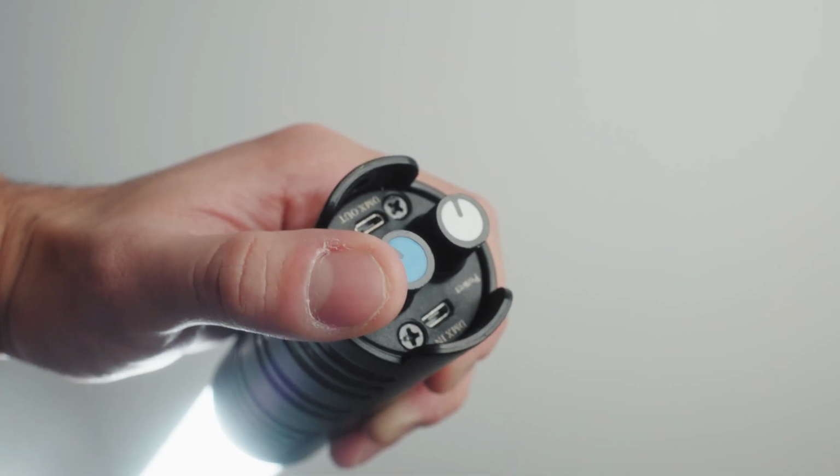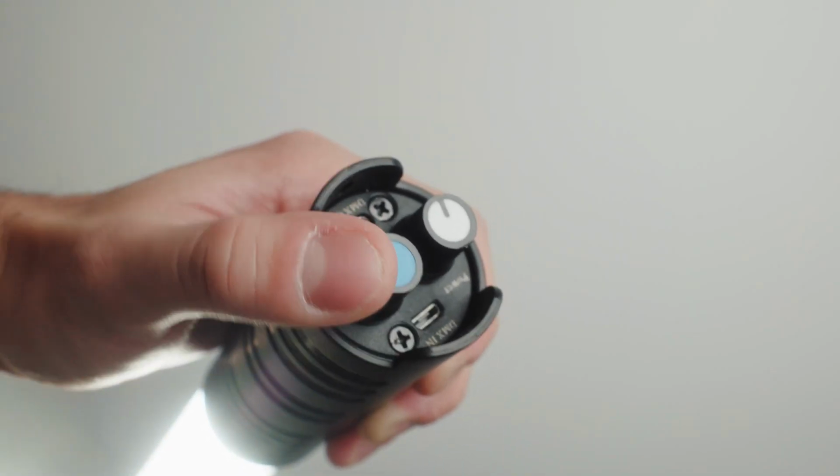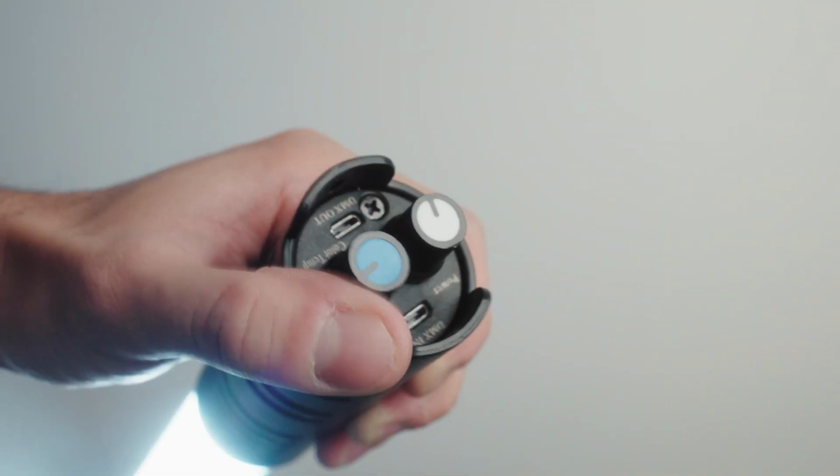On one end, there's two dials that let you control pretty much everything about the light. DMX in, DMX out seems like through USB. I actually prefer the dials on the Chameleon because on the Nanlite, the dial is very smooth and with one flick, you can go from 0 to 100%. And it is harder to do finer adjustments. Unlike this one, I actually have steps. Can you hear it? Basically, every single step or click you heard is just changing 1% of the value, so it lets you control very precisely about the light pretty easily.